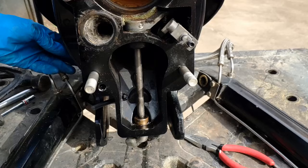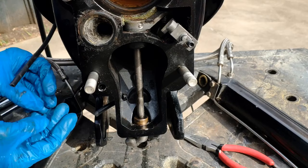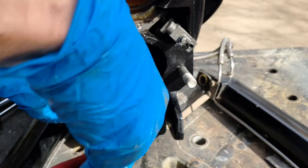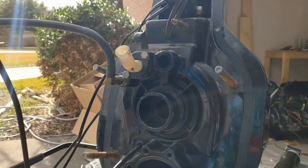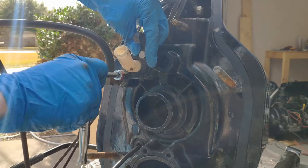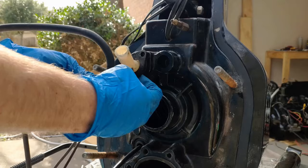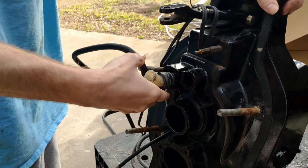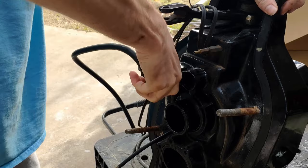On my out drive you can see the speedometer tube is actually broken — it got torn. There is also a little plastic clip holding the hose that I'm going to remove. Before you're able to remove the water hose, you need to undo two bolts in the back so you can remove a little rubber stopper holding the whole tube in. That rubber stopper may be stuck pretty good in there but eventually you'll be able to wiggle it free.